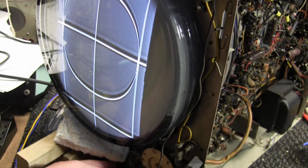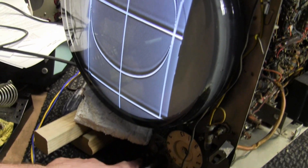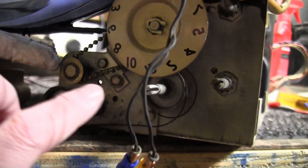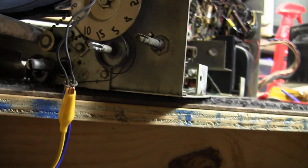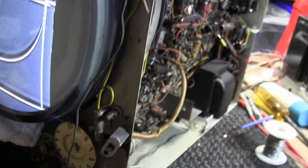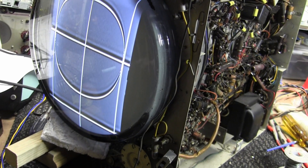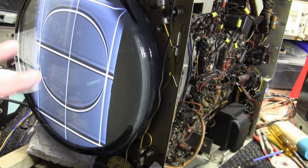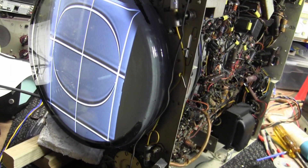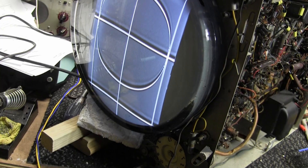While doing this I was adjusting fine tuning, which has a belt drive from this pulley here to this one — and the dial cord snapped, so I get to deal with that. The fine tuning is really hard to turn, probably has some dried-up grease. Instead of forcing the issue I should have flushed out the old grease and lubed it up before monkeying with it, but oh well.